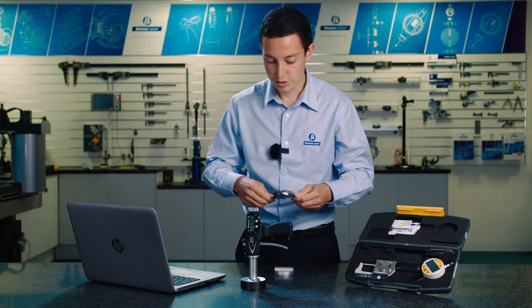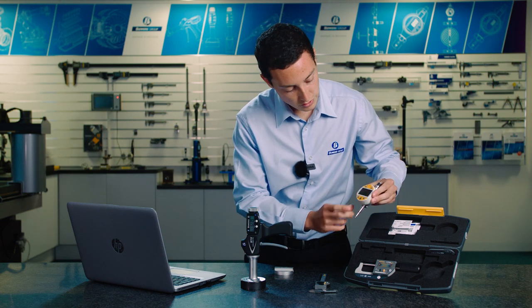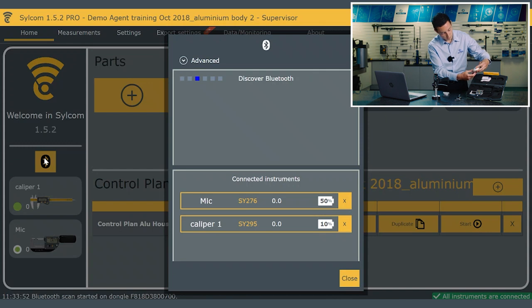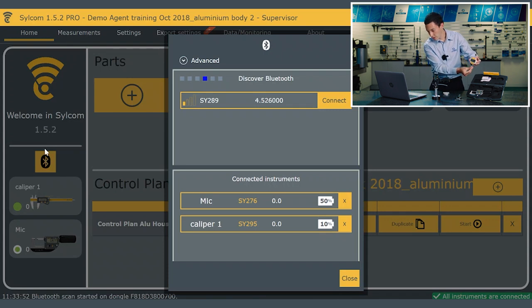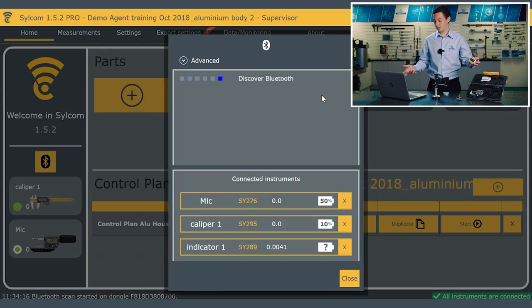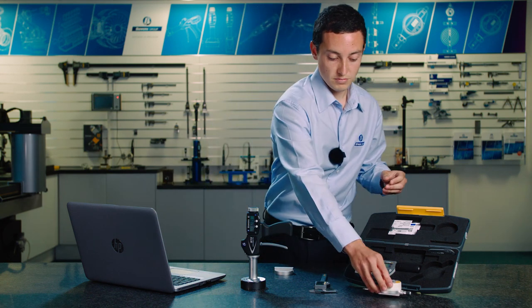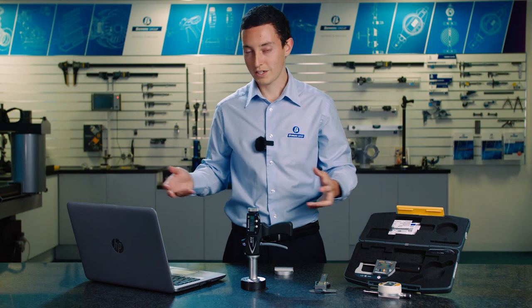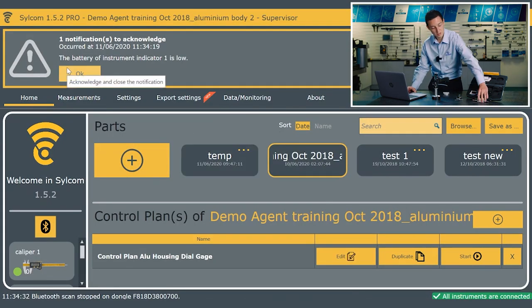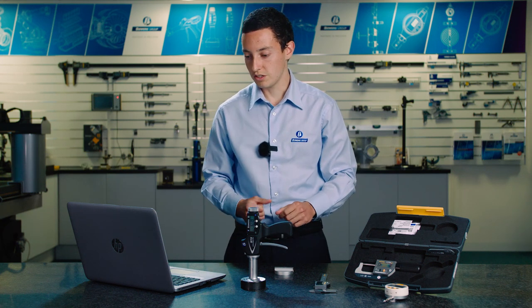If I wanted to connect another instrument, for example the indicator I've got here, I've just got to turn it on, make sure it's on the Bluetooth setting, and I can click on the Bluetooth scan. You can see it appear there — I can move that value around slightly so you can see it's moving live and we can connect. We can connect up to eight instruments using the Bluetooth dongle, but if I need to connect more that's not a problem — we can add another Bluetooth dongle and actually connect a total of 120 instruments if required. Once connected, the software also gives me an indicator if the batteries need changing, and I can get warnings and alerts linked to calibration dates running out.